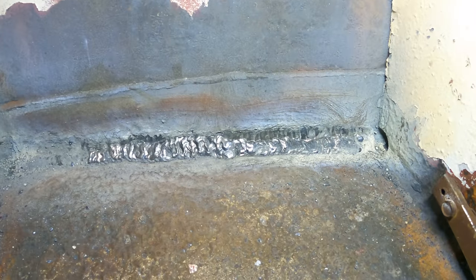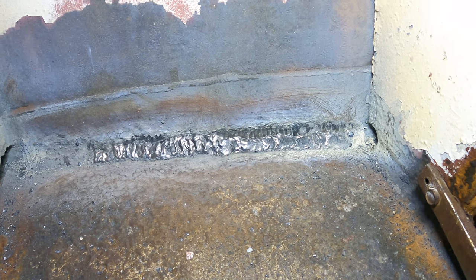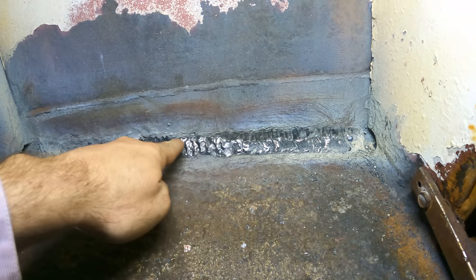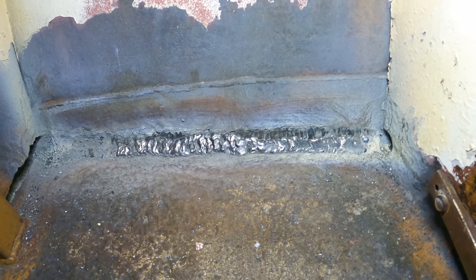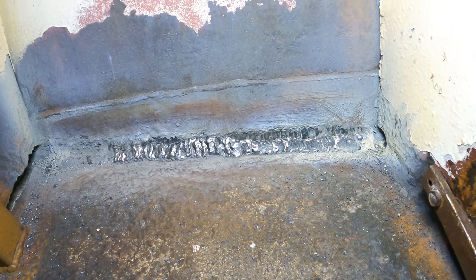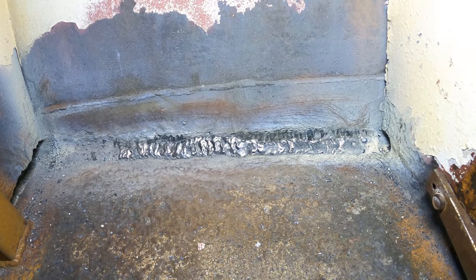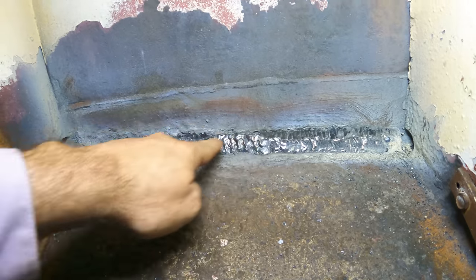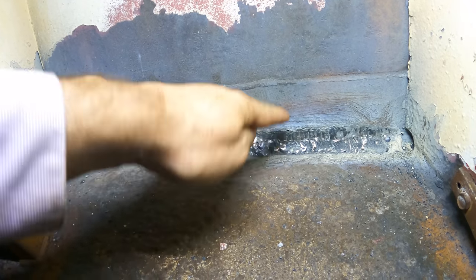There you have it. So that's basically a pad welded joint. So there's plenty of steel left in there now. In fact, there's a tiny bit of undercut. You know what? I'm gonna run another bead on that. It's kind of the beauty of pad welding, you just keep throwing steel at it. If you're not happy, like here, I don't know if that's thick enough to be honest, I'm going to add a bit more and I'll come up and over the original corrosion.